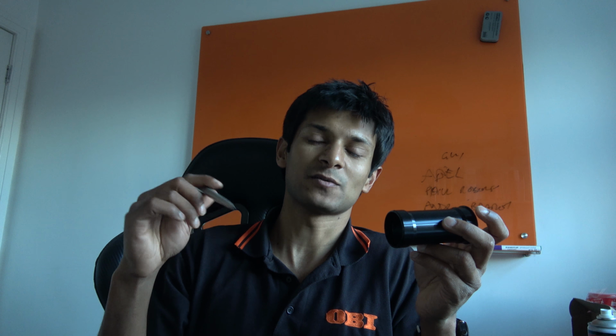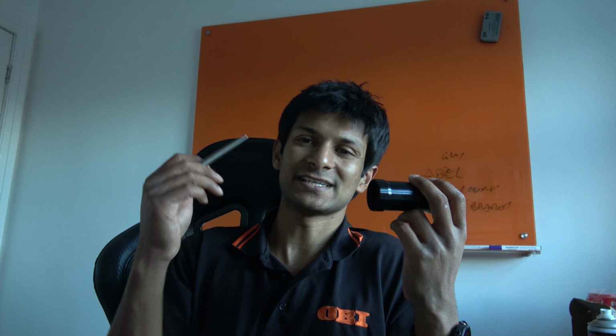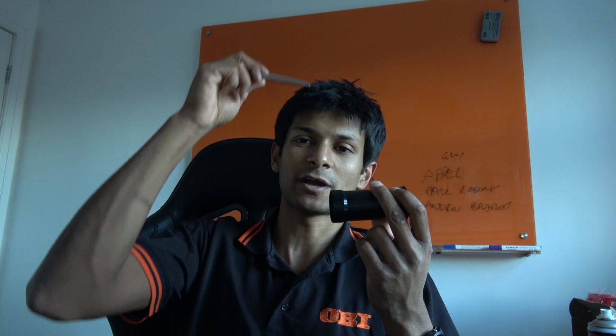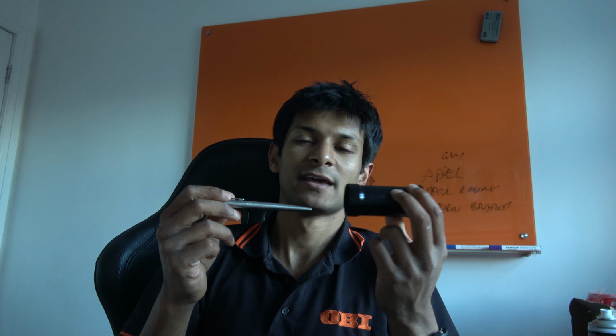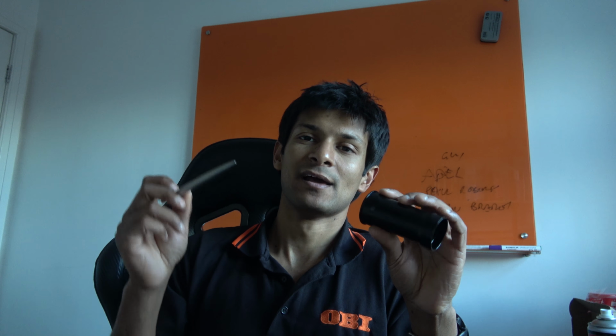So obviously there's quite a lot of things involved in making a bottom bracket, and the final bit of all of this was, I guess, manufacturing it. Manufacturing these types of bottom brackets is technically difficult, and the reason it's technically difficult is if you want to have very good bearing alignment, you can only machine this from one side. If you take this out of the lathe, turn it over, and then machine the other hole, you're almost guaranteed to be out.